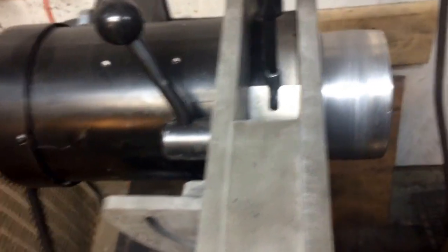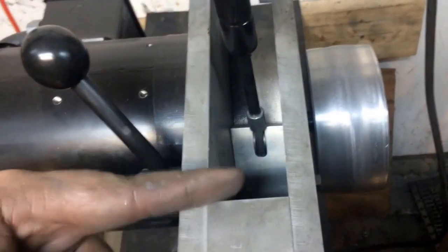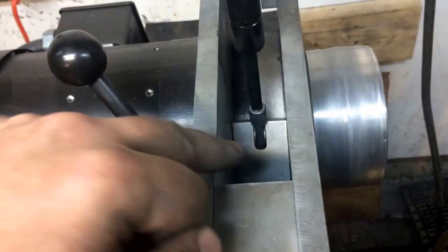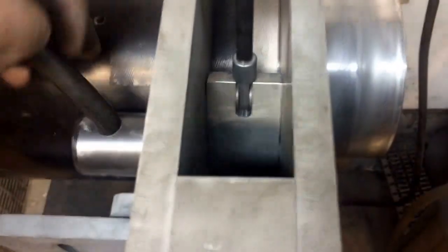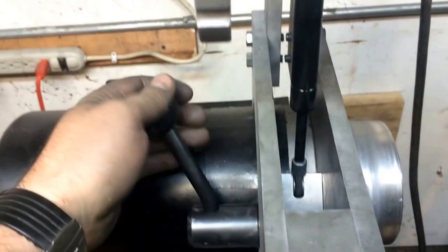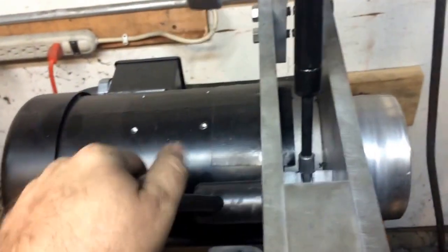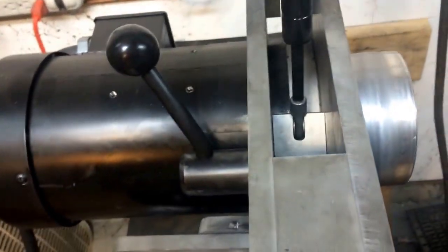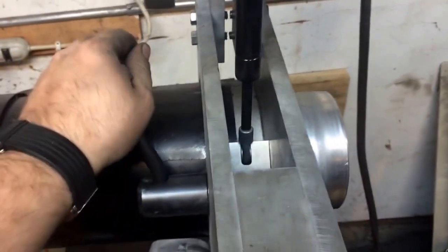With everything back together — you've got the center pivot screwed into the handle, and the stop pin offset from that going through the paddle. Both the pivot and stop pin go all the way through the paddle block and push it back and forth over that arc of travel. You can see those arcs on either side. Because it travels past center, the spring compression doesn't push the handle back. If the handle only went to about center it would push back down — but over center it locks right in at the extreme of that arc.